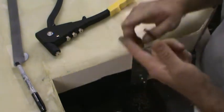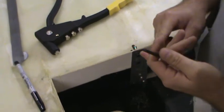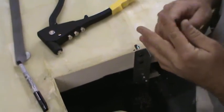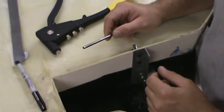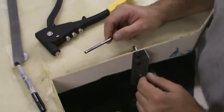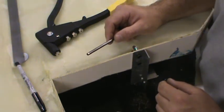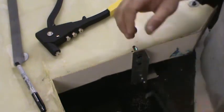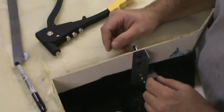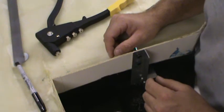And then you got to add flaps, slats, spoilers, all the spoiler control mechanism, all the slat control mechanism, all of the flap hinges. You're probably talking about another 4 pounds with a good layup on all that stuff. So now you're at 10 pounds for just 2 pairs of wings, and then you got to put servos, and then extensions, and then you figure another 1.5 pounds for radio gear in the wing panels. Now you're at 11 pounds for a pair of wings. That's heavy. In actuality, I would like those wing panels to be 7 pounds fully outfitted.